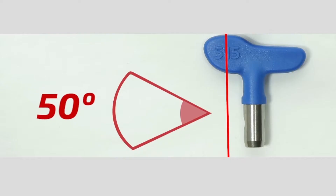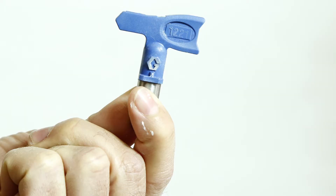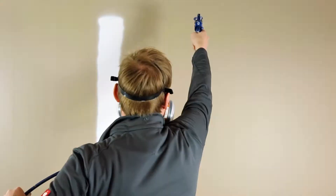When spraying sections that are quite thin, use narrow tips. When spraying an interior or exterior wall, you'd probably use a 515 or 517. A 5 gives a much wider spray fan width. For new construction where you're spraying entire sections and not too concerned about neatness, you can use spray widths up to a 1221 or 1223 — that's more like a meter or more of spray width.